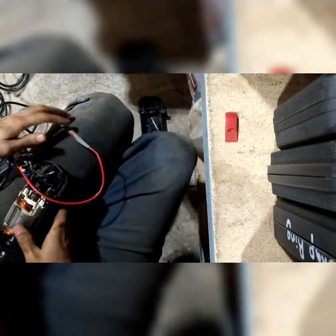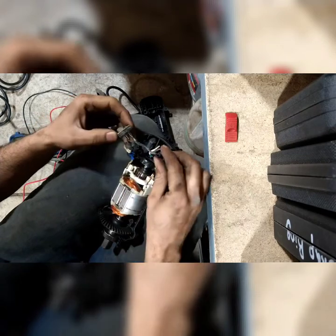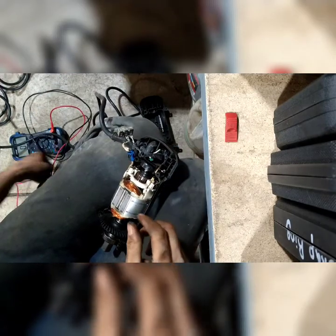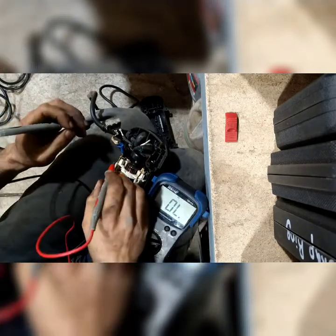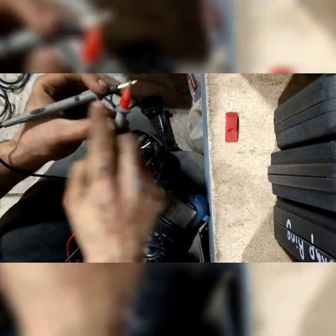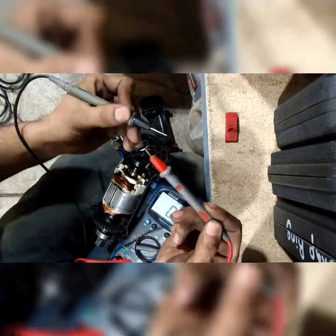All righty, let's see how well it looks. I got this guy here. Everything looks clear, so I'm gonna do an ohm test on this cable that I'm assuming is broken. This one might not be but it sure looks bad too, so I'm just gonna test them out. I know this one has a break in it, I already tested it. So with my meter on ohms and continuity mode — I know that sounds wrong — I'm just gonna test. See, that means the loop between these two terminals and the wires are perfect. This wire is not broken and this wire is not broken. There's no broken wire between positive and negative wiring.